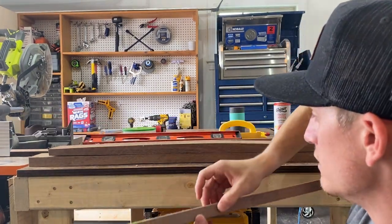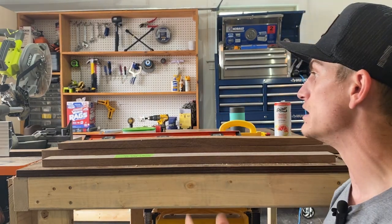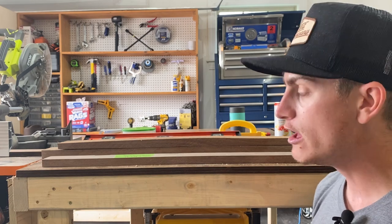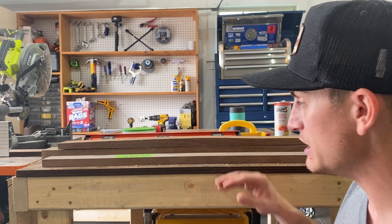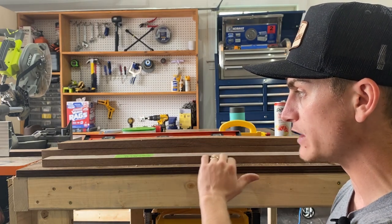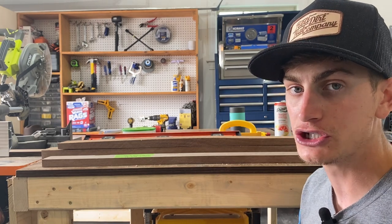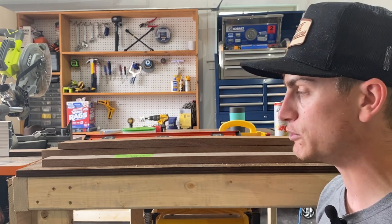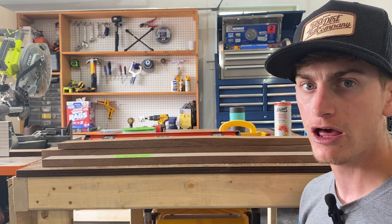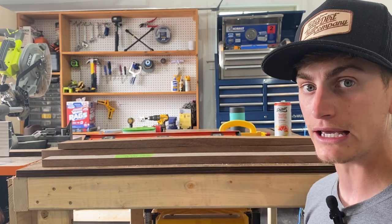I started with about 36 inches on the successful piece and didn't need nearly that much — I have scrap I trimmed off. This piece had maybe only an eighth of an inch of bow, making it easy to pass through the jointer and planer. Some of my other pieces had up to a quarter-inch of bow, which is a lot. Once you've edge jointed to get a straight edge, you trim the sides to final width. If someone watching knows why the technique wasn't working with only an inch of extra stock, please let me know in the comments.